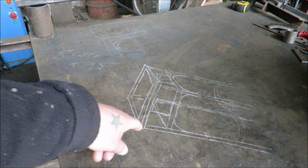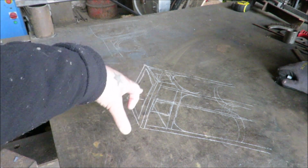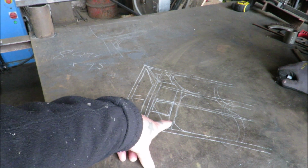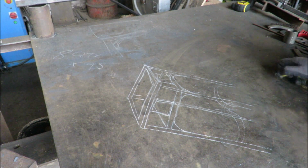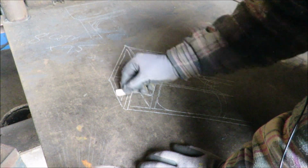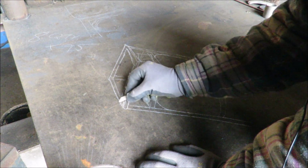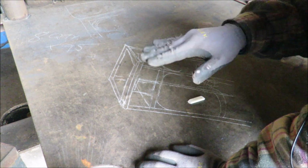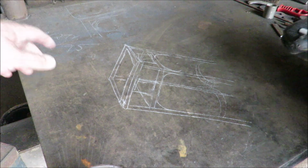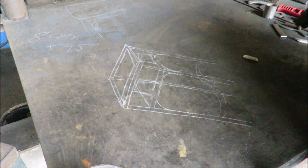So we've got to cut this steel now. Already that's looking amazing. So we've got to cut 4 legs, the 4 parts that make up the stand, the block rest, and these bits here. Now the way the jig's set up, it'll be a lot easier rather than make that as a ring, to actually weld that into the frame and have it so that the tops of the legs are flush. So it'll be easy to do that. We'll get a better flat surface, because there's always a risk if you're making just a square frame like that. The welds pull every time you put a bit of heat in and that sort of thing.